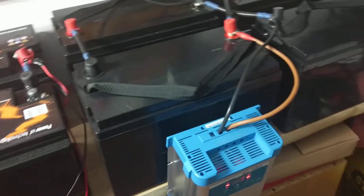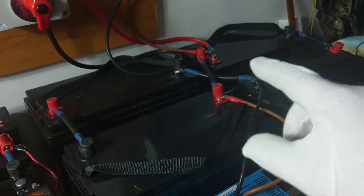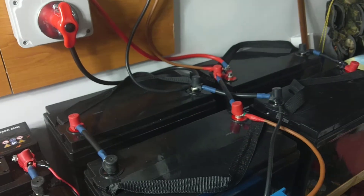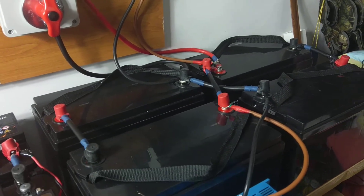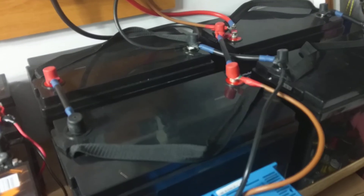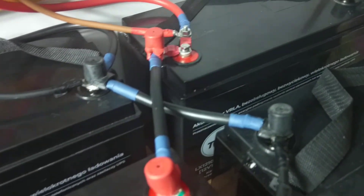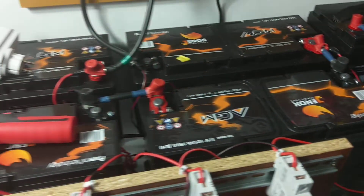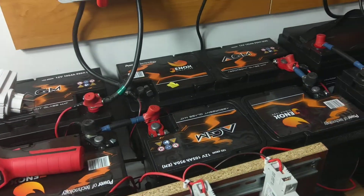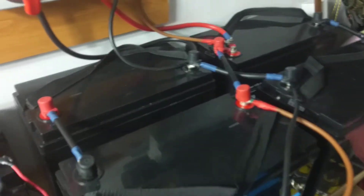What we will be doing today: as you can see here, this is four 12-volt batteries connected in series-parallel connection to give me the 24-volt connection. There are some safety features you need to consider — for example proper fusing. This other solution is a series connection at 48 volts, which is something different and much easier to accomplish than making 24 volts from four 12-volt batteries.